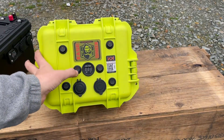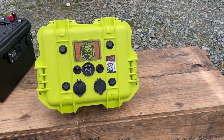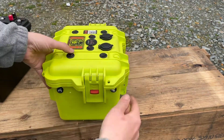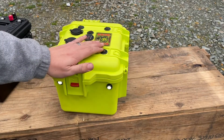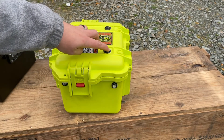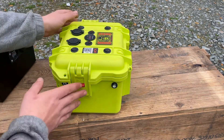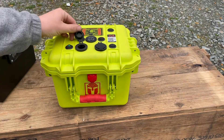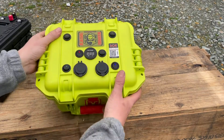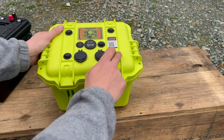Starting with the con case: we set it up with a master switch that provides power to everything, and here on the right you have your voltmeter — we're reading 12.7 volts. I set this one up with multiple switches for lights, so you have two lights on either side with their independent switch, and the same on the other side. I did that so whether you're left-handed or right-handed it didn't matter — you can control where you're putting light. Up top there's a 12-volt power source with an independent switch, plus a USB charging port with a 1-amp and a 2.1-amp port with a dedicated switch.